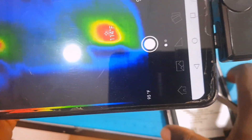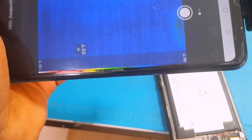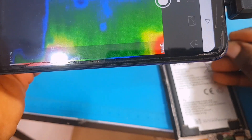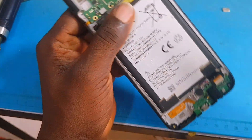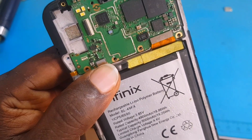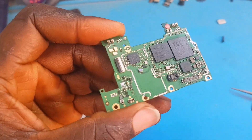As you can see, we have two heating components right on this PCB. Let me get rid of this reflection from the bulb. Pay attention to those heating spots — those ICs are shorted. Remember, the power IC was on the right side of the PCB, and on the left side there is another component that is also heating up. I'm going to show you that component in a few minutes. There are some components that might be causing the power IC to heat up — it could be a capacitor, a diode, or a resistor. Let's remove that other heating component.